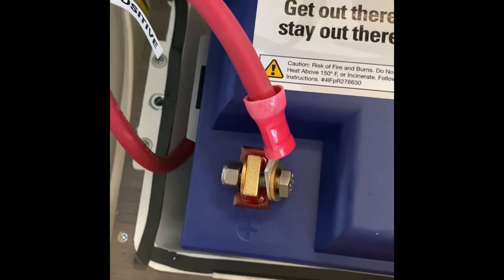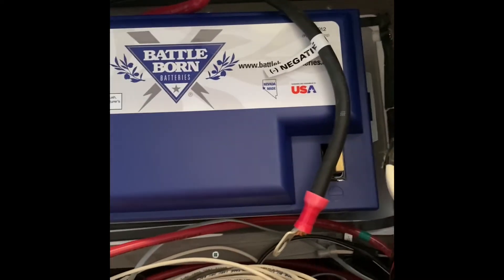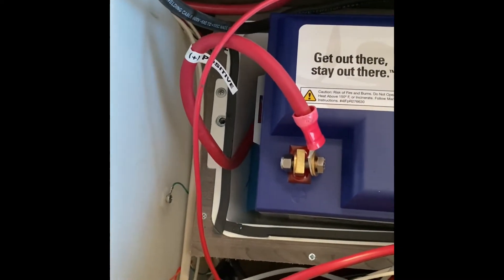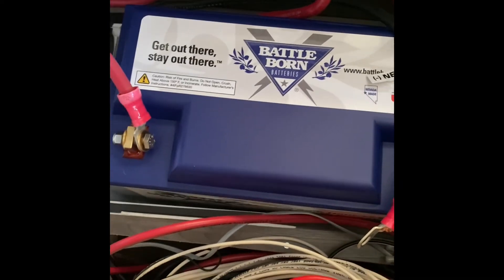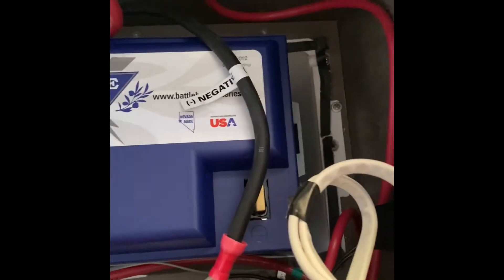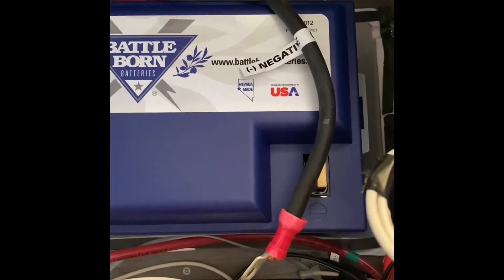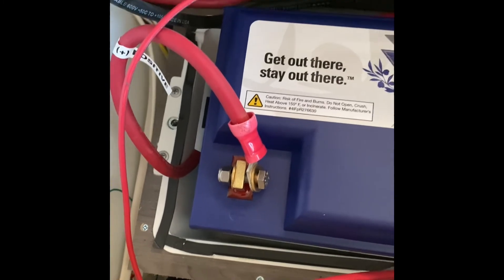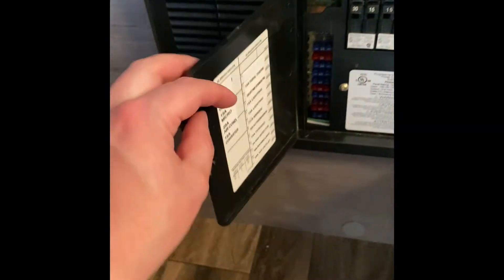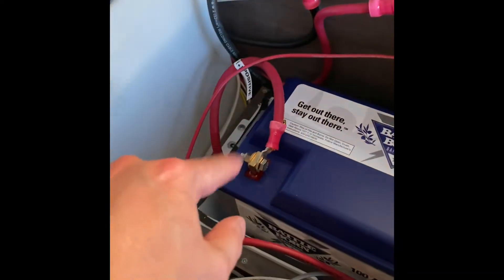You'll notice I switched the orientation when I pulled the other battery out — so the battery terminals are in a different position. I'm waiting to hook up the negative. I kind of swapped it when I put the Battle Born battery in, so it's in a little different orientation. The positive terminal was over here, so just be careful when you put it in and make sure you get your positive and negative on the right posts. Half inch bolt there. The one thing I need to do before putting the negative on — before getting the whole thing connected to the camper — involves the inverter.